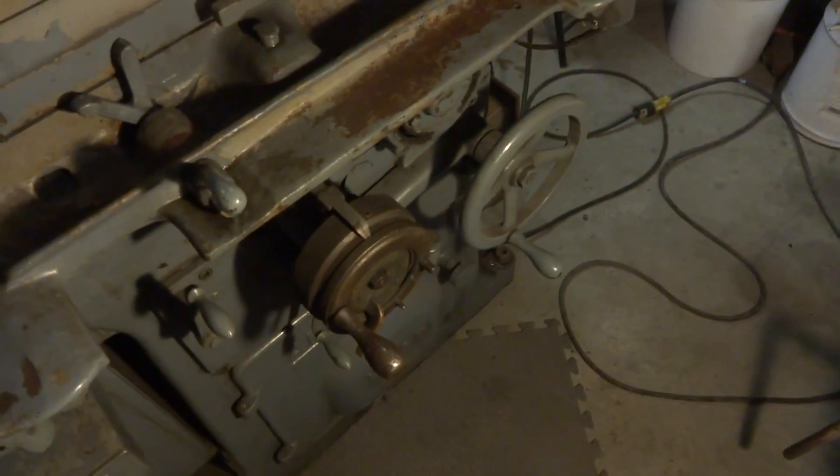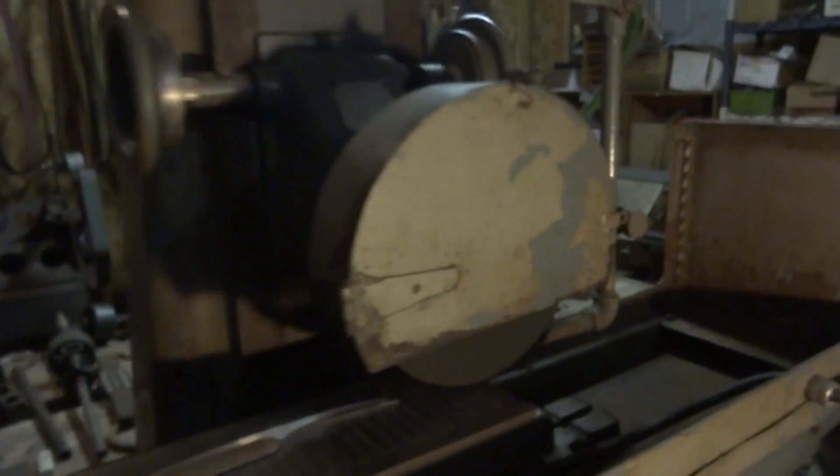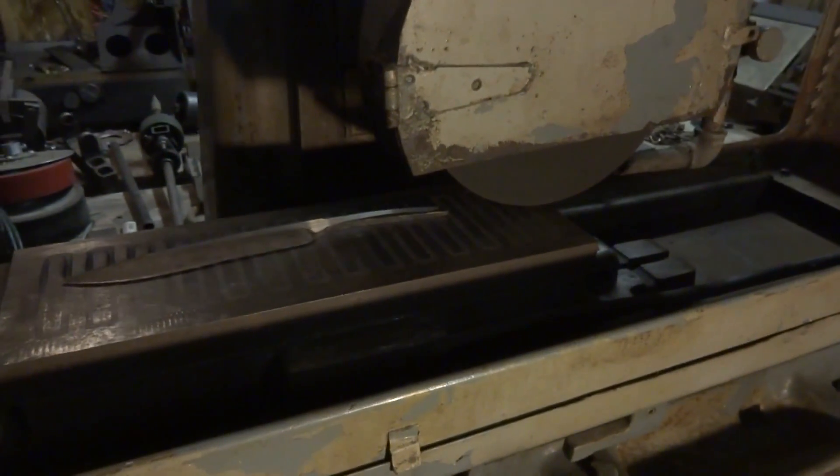So that's already making it easier to grind than if I had to crank both cranks — it's like halfway to automatic grinding. I'm going to dial in another 10 thou. Set the tension screw. If you don't do that, the head falls into the work and that's alarming. We're going to change the direction on the handle to out.